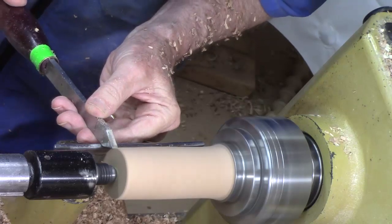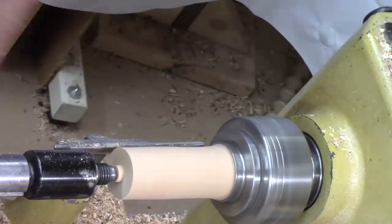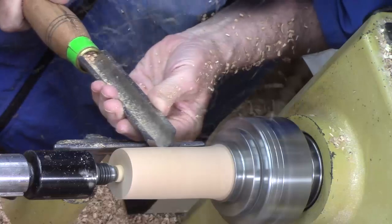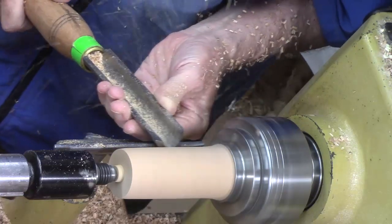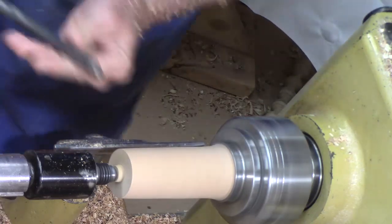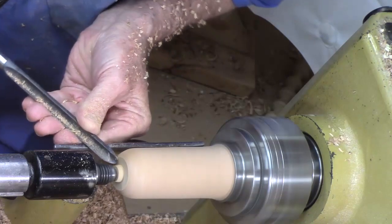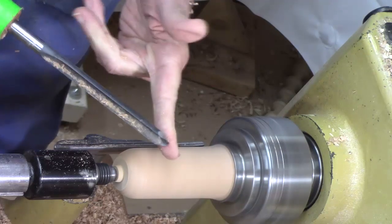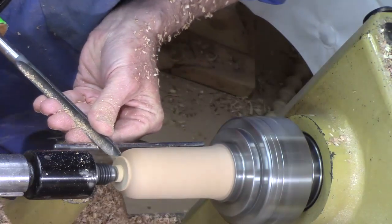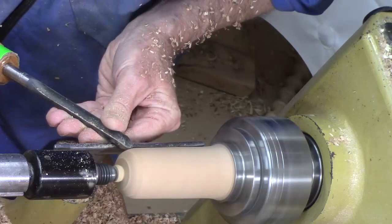Down just a little bit here. Keep rounding it off. Big bead, and there's the bevel, so that's the angle, about 45 degrees we need to finish this cut in. Lift, rotate, push, all one time, whoop, lost bevel support.